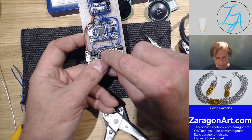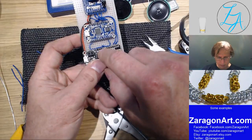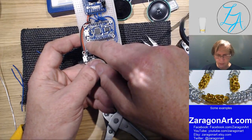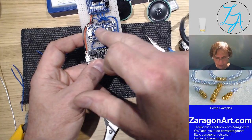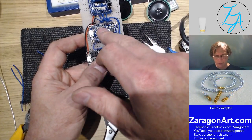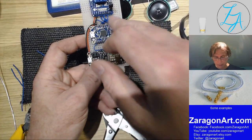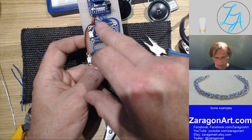13, I think it is. Well, that one there is the same one, goes to the reset. It's that one there, that goes to the reset on there. So what it does is it holds that in reset when it's not using it, which means that it grounds, I think, all the outputs so that there's no noise generated whilst it's not playing.